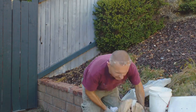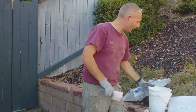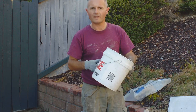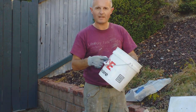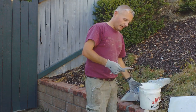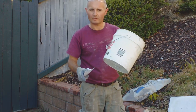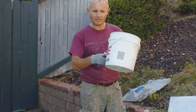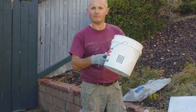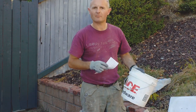And you've got hydrated lime type S. The proportions are: I use a little two-gallon bucket. There are four of these filled with sand — each one is 30 pounds, so 120 pounds of sand. Then I use one complete full bucket of Portland — that's 25 pounds. And I use a half bucket, one gallon, half of this bucket full of lime — that's about 6 pounds of lime. And then you need around 20 pounds of water.